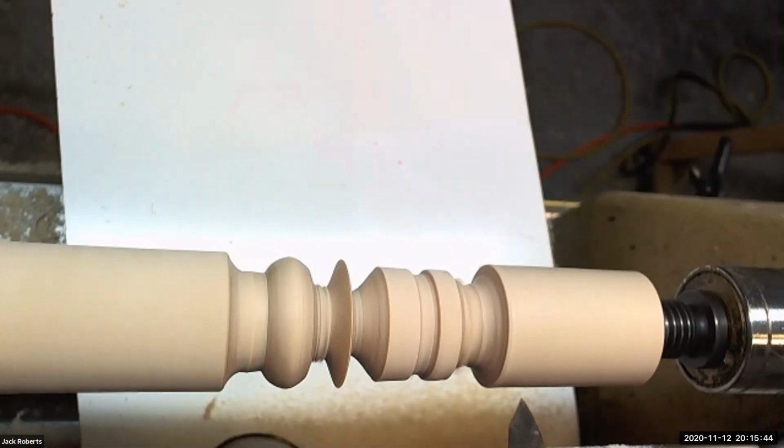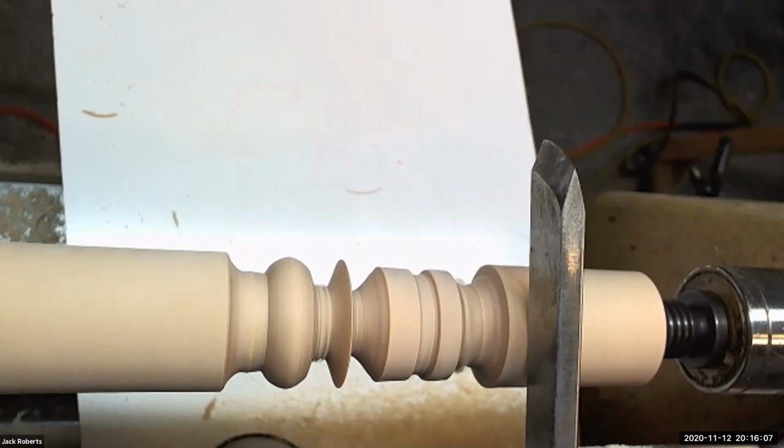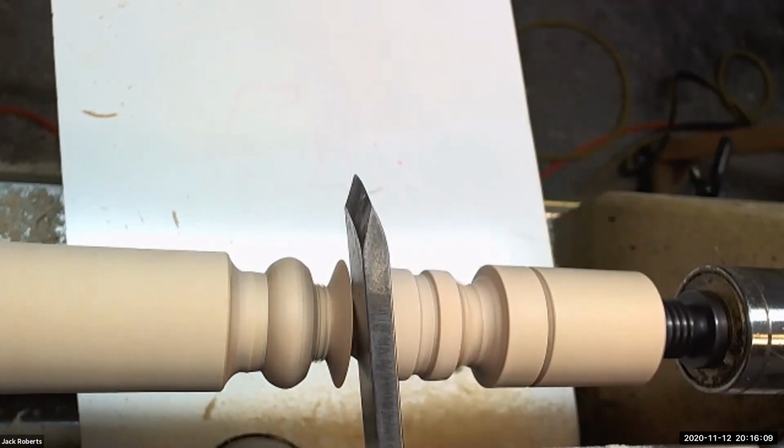If we take the toe, we could start us a V cut like this. And we can do that same V cut that we were doing before. All I'm doing is starting on this toe, and as I start in, I'm turning the tool just a little bit. Once I get this tip supported, it's got to be straight up and down. It's got to be perfectly straight up and down.